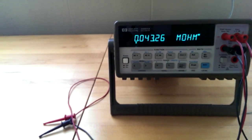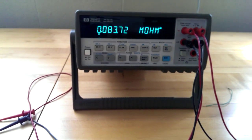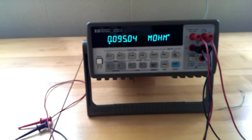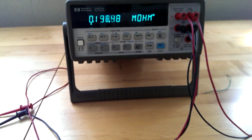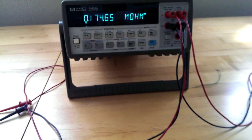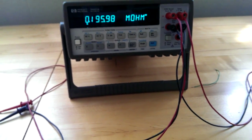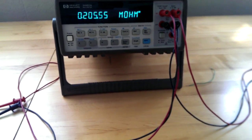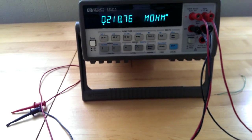So you're going to find that when you use the four-wire method, I'm not showing you exactly how to do it as far as hooking up the wire and hooking the leads to the wire. I'm sure you can figure that out, but you're going to find that the resistance is about 1/10 of what it was with just the two-wire mechanism. And so part of your goal is to figure out why that is and how this works. Okay, that's the end of the instructional video for experiment 1, part B.